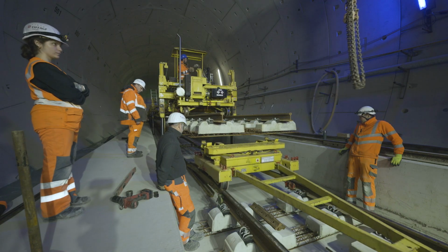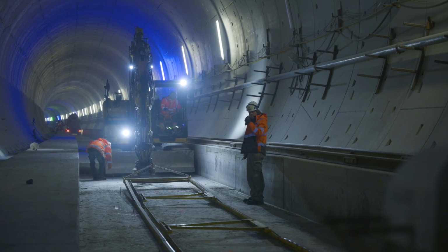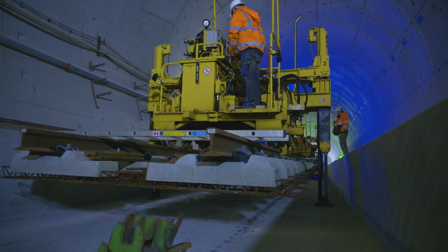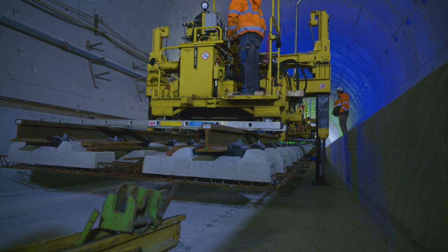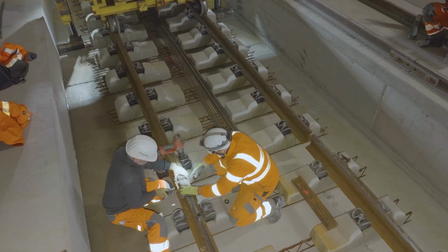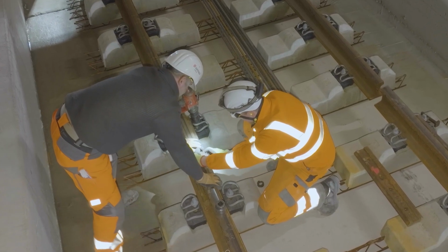The connecting ramp is removed and the provisional track on the other side pulled forward as far as the elevated track section. The track lifters now slowly lower the track section onto the bed in front of the existing line. The 2 rails on the new track section are bolted to the rails of the track already laid. The joins are later welded.